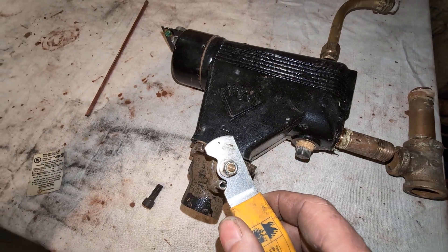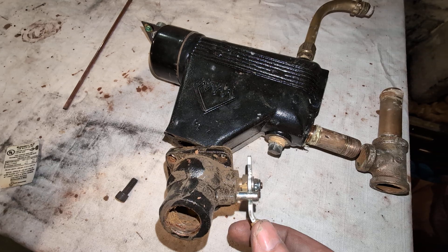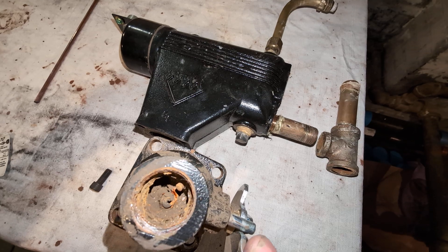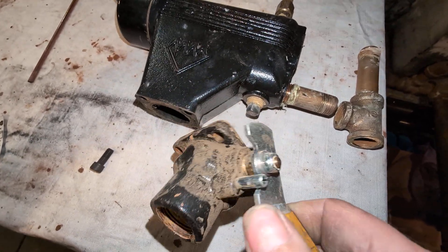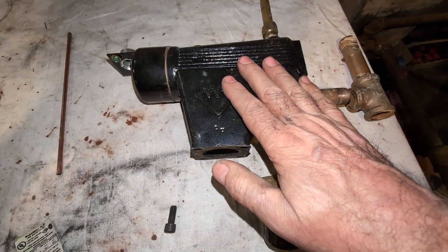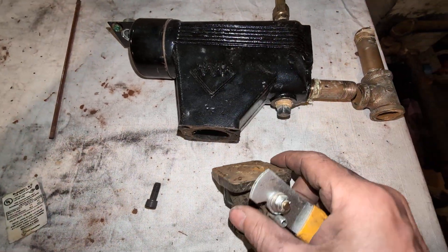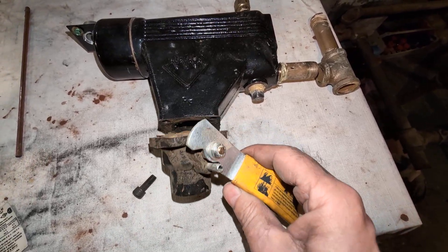This is the blowdown. We've discussed about this. Usually, if this starts leaking, you want to replace this with a dirt pocket. This got blocked off — it was originally installed on the boiler, and then someone came along later and put an electronic low-water cutoff on there. But you want to remove these bolts and put on a dirt pocket.